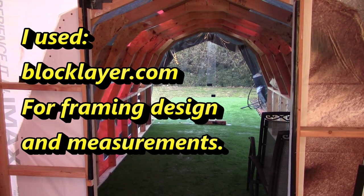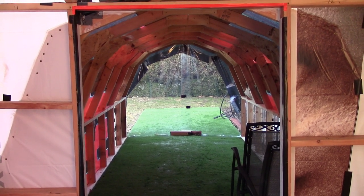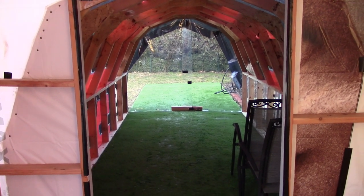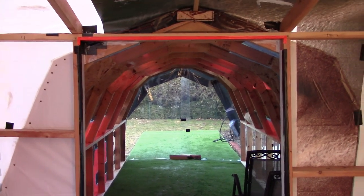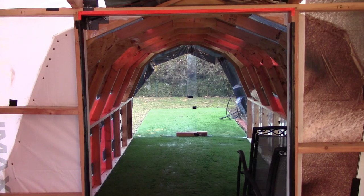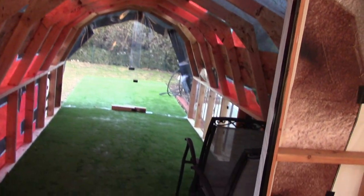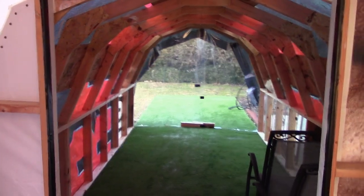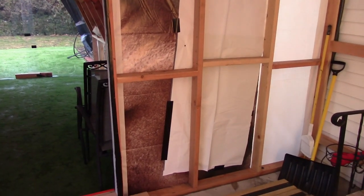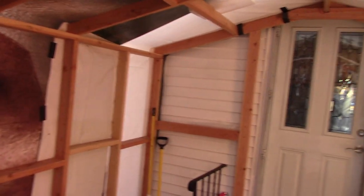With the gambrel plans you just plug in what you want — a guesstimate of your lengths. The length is seven and a half feet give or take. The height is six feet eight inches — I have everything written down because I built this two months ago. The width is seven feet ten inches, height is six-point-eight, and the walls are 34 inches high. I did 24 inches on center for the studs.